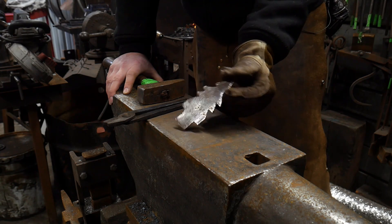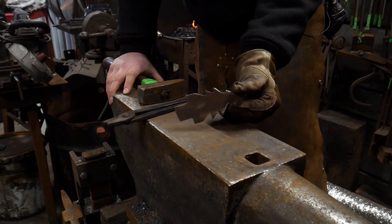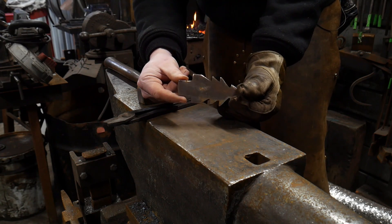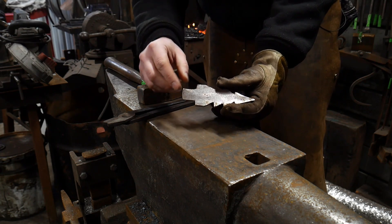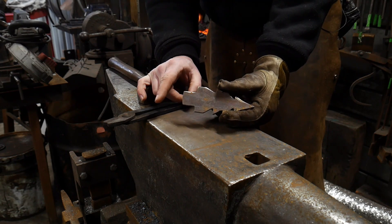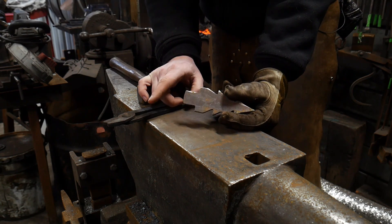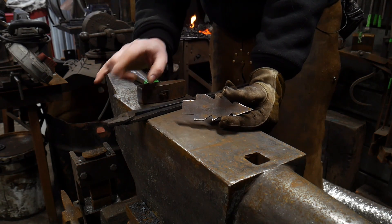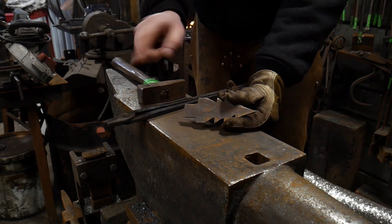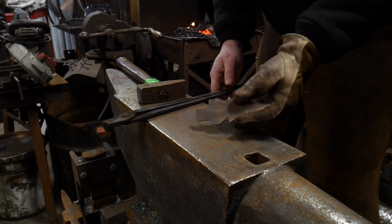Now, this blank is from the same Christmas ornament design, but we want to turn it into a hook. This shape isn't really conducive to doing a hook as-is, so the revised template will have a long tail that's about 3/8 inch by about 3 inches — so 9.5mm by about 75mm long. That'll be appropriate for drawing out a keychain hook or any hook style you want, including a split hook.